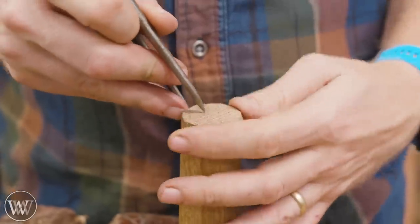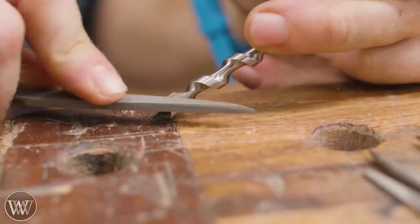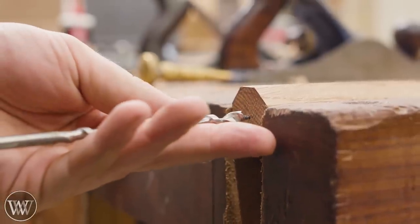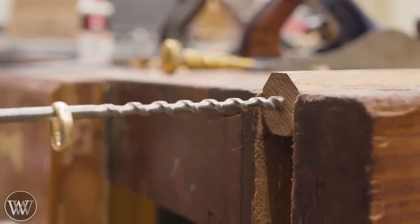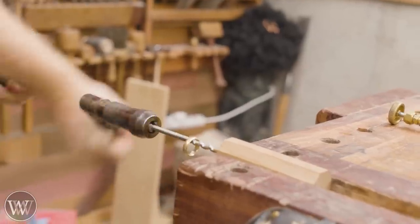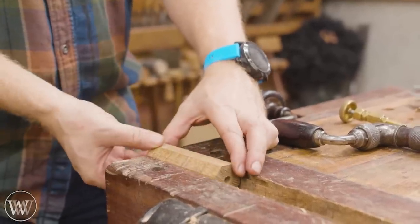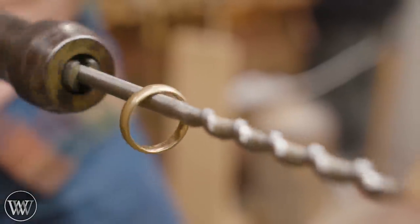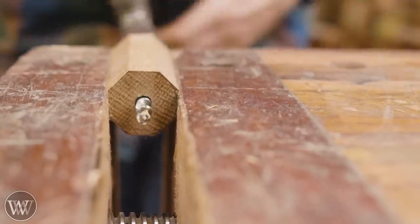Next I need to find the middle point so I can drill a hole all the way through this — from one end to the other. Keeping a bit perfectly on track means it's got to be sharp, so I'm going to sharpen my auger bits. I find it much easier to drill from one side most of the way through and then come in from the other side and meet it halfway — you get a much cleaner surface. I'm also using the ring trick so I know when I am level. We flip it over and drill from the other side, and the ring lets you know if you're level: if it gets too close to the threads you raise it up, if too far away you lower it down.